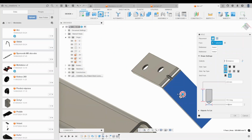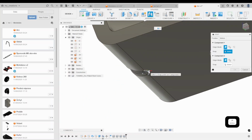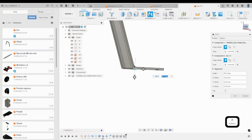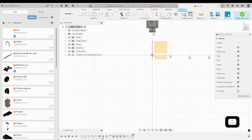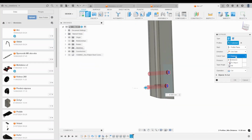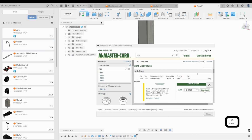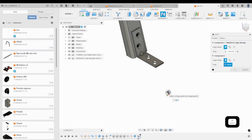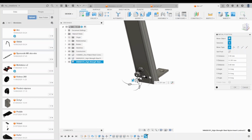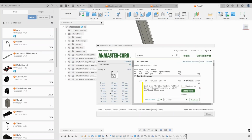But before that, the leg needed to be cut so it could fit under the steering tube. So first, I slid the linear coupling onto the steering tube. Just for this step, I tightened it roughly in place, so that the chair leg lined up with the front edge of the seat. Then, I measured the distance from the bottom of the coupling to the baseboard. I marked this measurement onto the leg and cut off the same length from both ends.